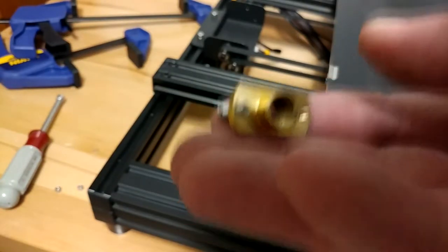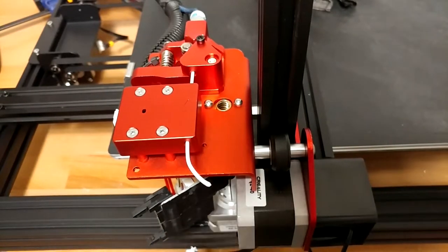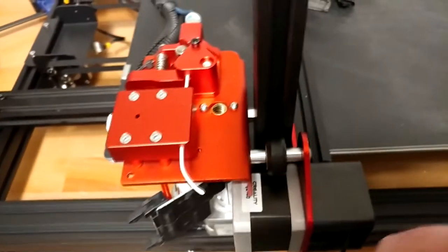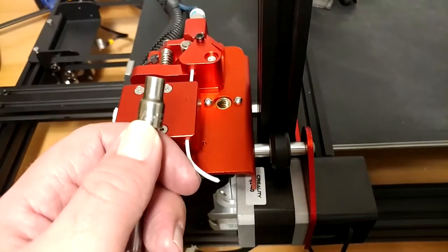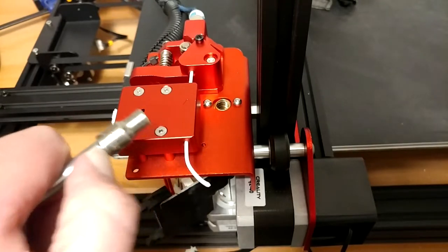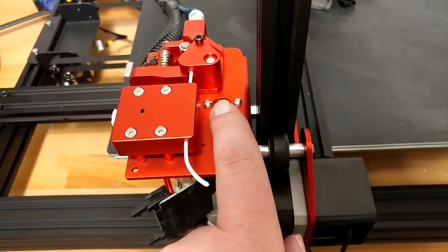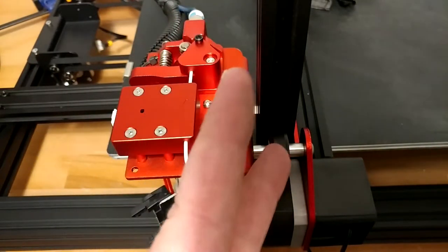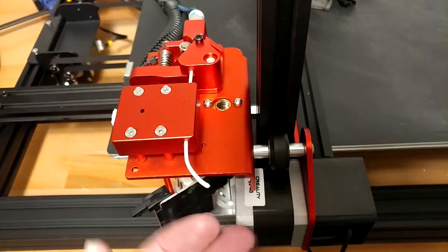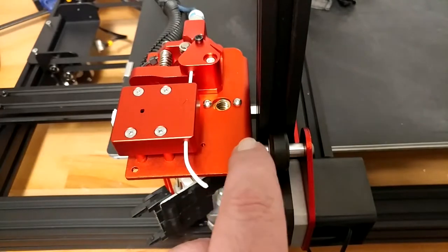Time to have a good time putting that guy back on and try to adjust it again. So the nuts that go on the back of that thing are actually 5.5mm — how I was able to take it apart with a 6mm, who knows. Since I don't have a 5.5mm socket — that's 7/32nds in the US — a nut driver would be preferred. The other thing is while I was messing with this, it occurred to me that these are probably fine Z height adjustments for left and right side. But as they were set up from Creality, they weren't doing anything — the nuts on the bottom are intended to be jam nuts to lock your adjustment down, but they were just loose in space.